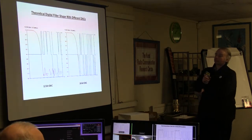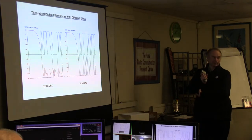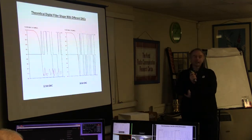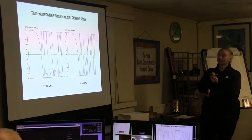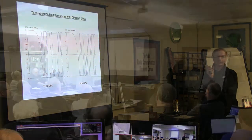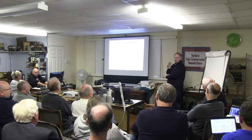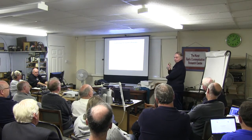So, what to do about it? I can't see anything you can do with the current hardware. I think it's going to have to be a new DAC. So I'm looking at a little board you can replace the current DAC with, or drop on, or connect somehow. It won't be homebrewable, well, not by me anyway. It'll be such a tiny 0.65 mil chip. I wouldn't solder it myself, so I wouldn't ask anybody else to.